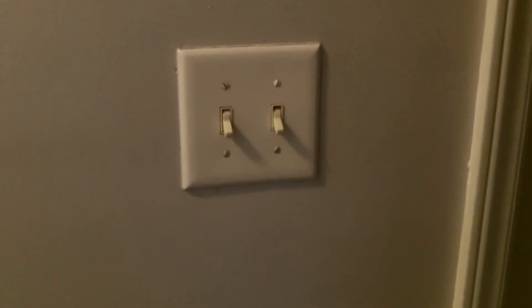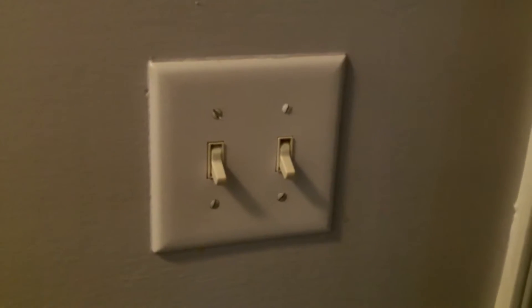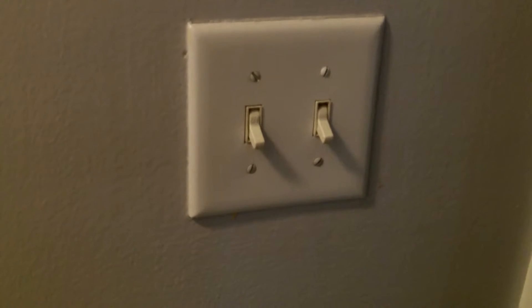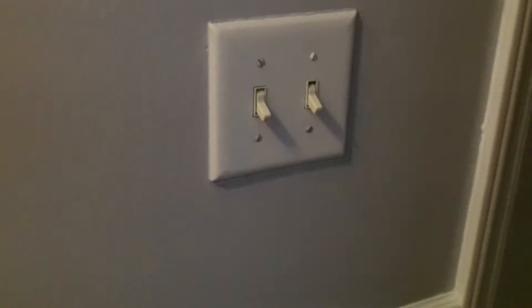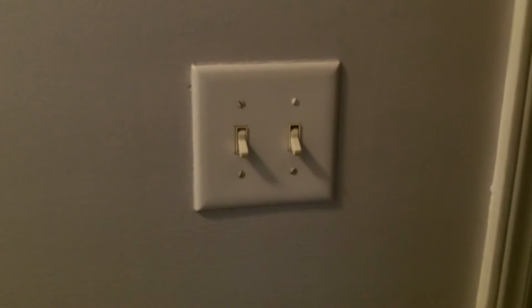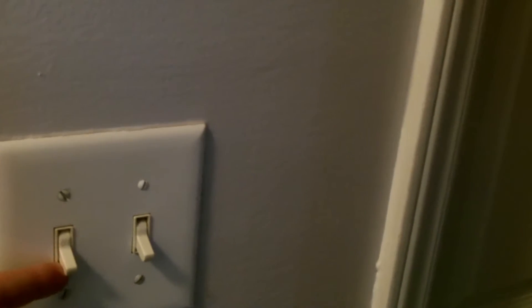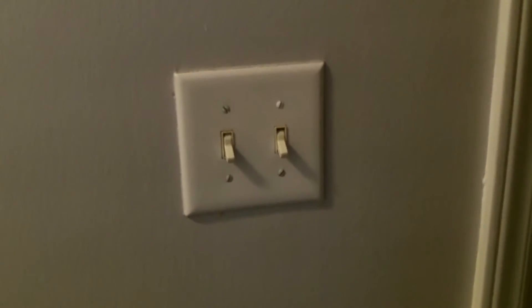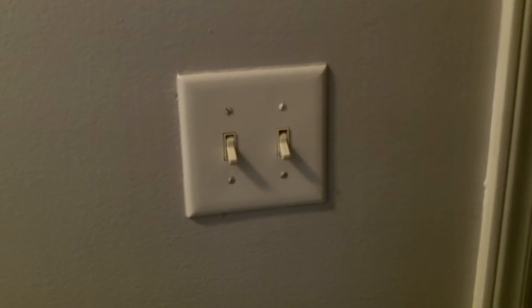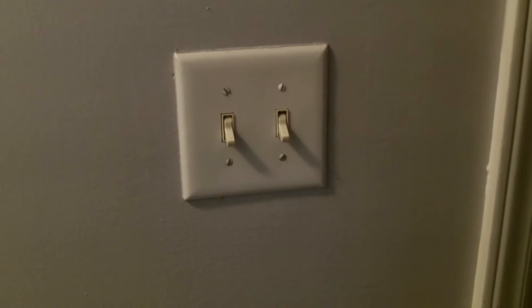Here's the outlet where I'm going to be putting in my new switch for the fan. I'm going to use a three-way switch so I can have it up for just override and down for normal thermostat use. I know people online like to have two switches with a master and an override, but I didn't want to do that — figured what's the point of turning it off. I made sure that everything else on this circuit won't be overloaded when I add the fan, which runs at about 4 amps.